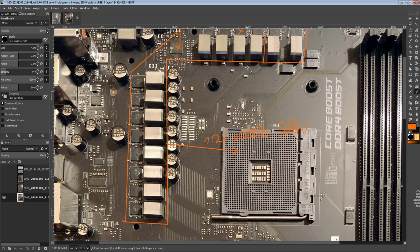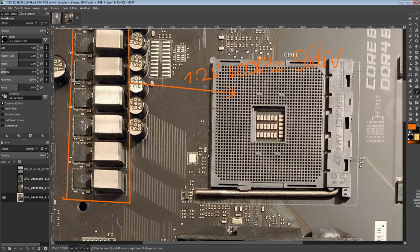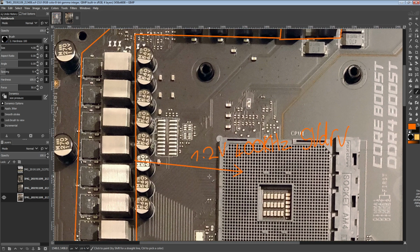I don't know how much longer. But I'd assume it's a lot, because the recommendation from International Rectifier is to just straight up run them on 5 volts unless you're desperate for more efficiency. So, funnily enough, the efficiency curves are spec'd at like 7, if I remember correctly. So yeah, the datasheet, that's the really fun part.